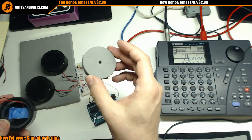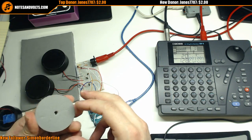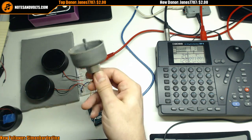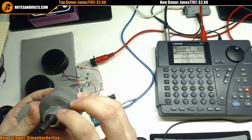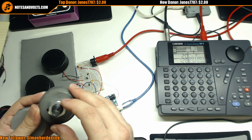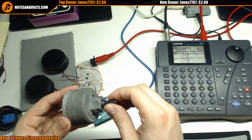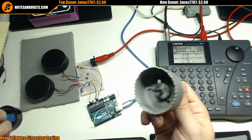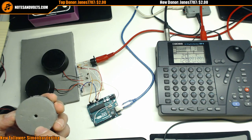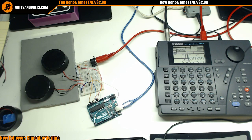Next, take the EVA foam. I cut it into nice circles using a hole saw — a two-and-one-eighth inch (54mm) hole saw. I put this in a drill press, though you can use a hand drill, and it cuts through the foam like butter. You can crank these out by the hundreds. It also leaves a nice little center hole you can later run the wires through. Cutting that by hand would be a real pain.